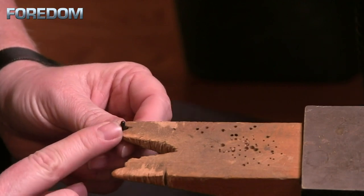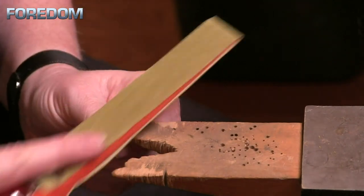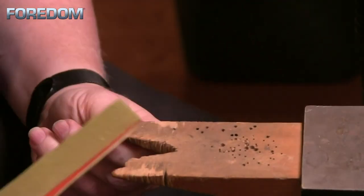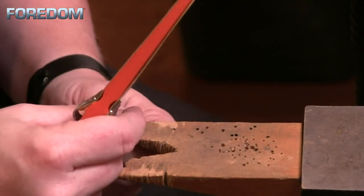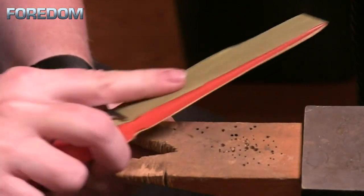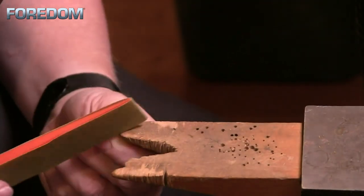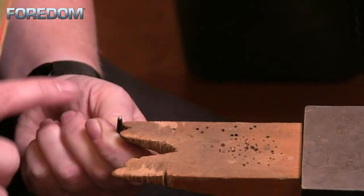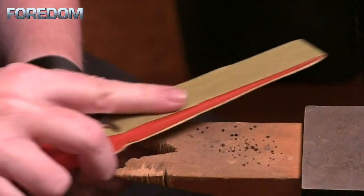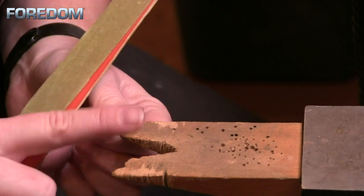For this ball end, I'm going to start by knocking off the oxide that's on here. This one is not going to take very much at all — this is just 30 micron sanding or polishing paper. Because I really like the shape of this one, all I'm doing is removing that oxide. And this one is now ready to go.